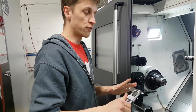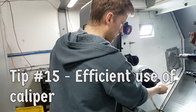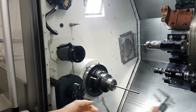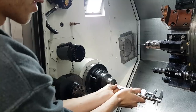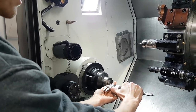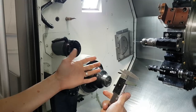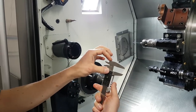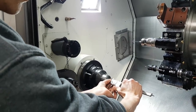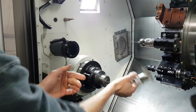Another one I've mentioned before but can't mention enough — it took me far too many years to figure this out. Calipers on a lathe: my code will tell me the stock needs to stick out so far. I used to go like this and the numbers are upside down, or use the tips, which is annoying. I never realized there's a step from here to here until about a year and a half ago when somebody showed me — but that step measures the part perfectly. If my stick-out needs to be 450, that's so much easier than all the other methods combined.